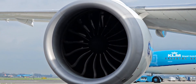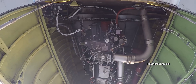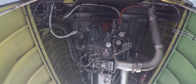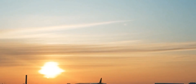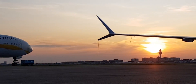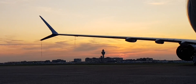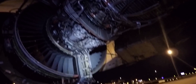The aft external power receptacle is only used when starting an engine when the auxiliary power unit isn't able to provide electricity to the engine starters. It can also be used for running a cabin air compressor on ground and running three hydraulic pumps on ground without the APU. This is mostly done during base maintenance and normally not in line maintenance operations.